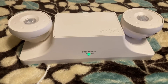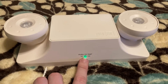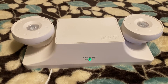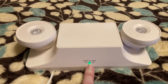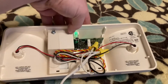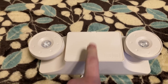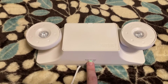I'm about to illustrate the first problem with the EZ-2L. Most emergency lighting units have a bimodal LED on the test button, which turns red when your battery is not plugged in and green when it is, regardless of whether it has a full set of self-diagnostic utilities built in or not. The EZ-2L basic model does not have this feature, so it's a little misleading and may lead to some people not plugging in the battery and thinking the unit is ready to go. If someone flips the unit around, sees the battery lead, and has no knowledge that the EZ-2L now has a front-mounted battery compartment, they're not going to know to look in here to find the battery and connect it. So when the lights go out and you need your emergency lights, nothing will happen.